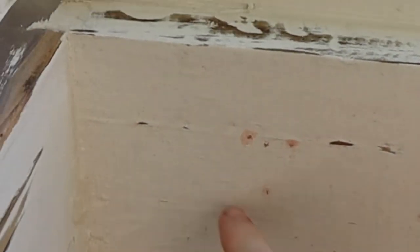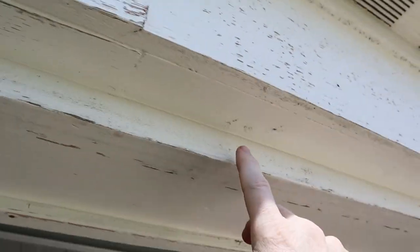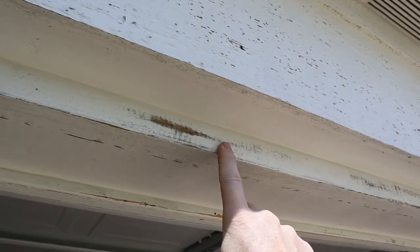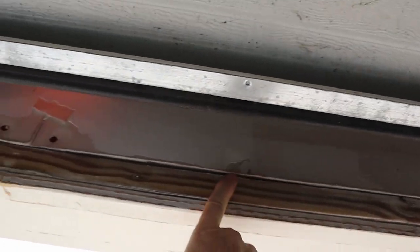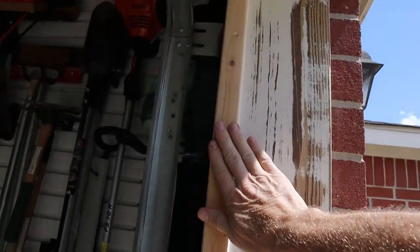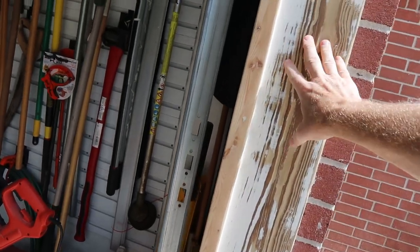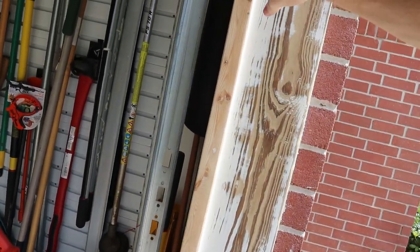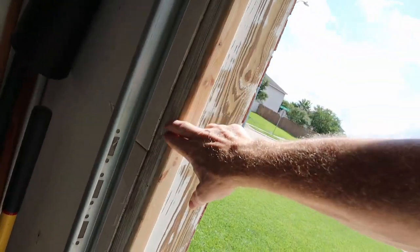I'm going to go up over here. See those red spots shining through? Those weren't there before. See how dark it is in areas along here? To me, it looks like it's trying to mold. So I'm going to sand all of this, sand inside here. This part looks pretty good but I'm just going to re-sand and touch it up. Over here I already took all the paint off — it did really well. I'll start with 80 grit and get it all done, then come back with 180 and smooth it up.